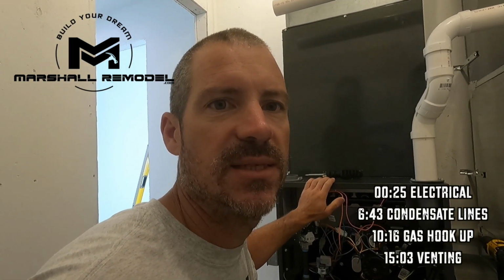Alright, we're going to cut a hole in the roof for the vent. We're going to use a one-piece vent, so it's got the air intake and the exhaust in one unit. Whenever I run anything through a metal roof that's just metal, I make a box like this. I got 3/4 inch plywood, so I subtract that from a 2x4, so I cut 2x4s at 2 3/4. This is 22.5, so it'll fit between the girts.